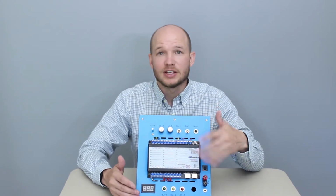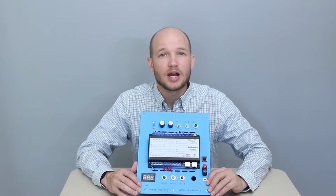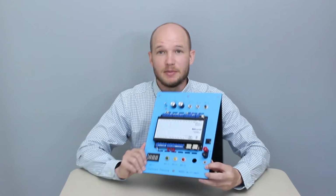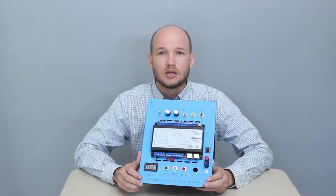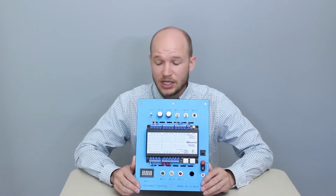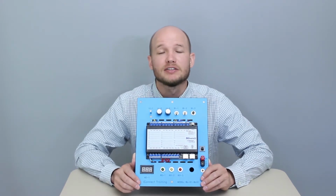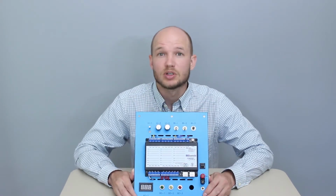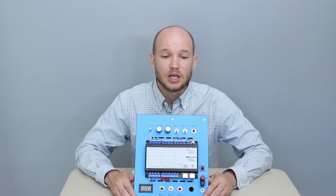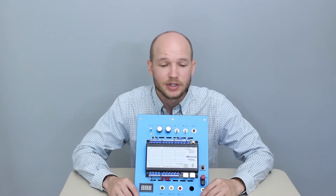The input and output devices are pre-wired, so you're not messing with any wiring. Later in some of the labs you might get into some of the wiring or some of the testing, but yeah, it comes as a complete unit. This thing is ready to go out of the box. So level 1 curriculum that comes with this is great. It's using the BACnet protocol, it's web-based, it's highly interactive. It's using Sedona programming, and that's awesome because that's an open source, free programming tool, and essentially it transfers over to some of the other programming tools out there.